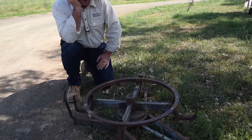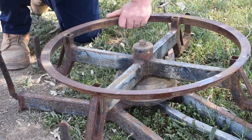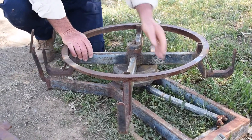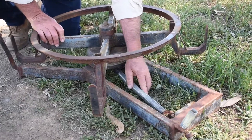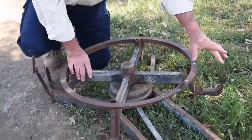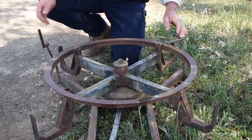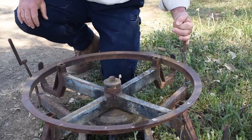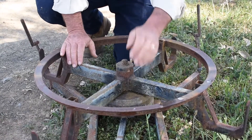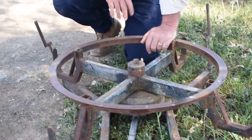This is a very early prototype — it never actually made it into production, but you can see what we were thinking here. This is a drum brake out of a mini; it had an actuating arm, we had the one-piece design which we've stuck with, but no outside ring. You had a top piece to trap the wire in, which we found we didn't need. Too heavy and clunky, and we had to get mini brakes, so it never really got off the ground, but it was a sort of proof of principle.